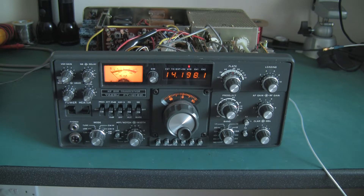What I'm going to do is check its received performance to start off with, then how many microvolts it needs for S9 on the S meter, the receiver conversion gain, the frequency accuracy, the power output, and transmitter harmonics. We'll do this for all bands but I might only show you the results for about one or two bands. So we'll start off with the receiver performance.